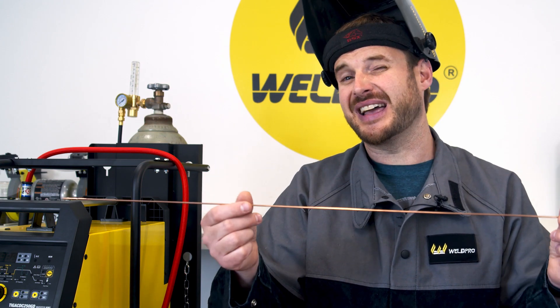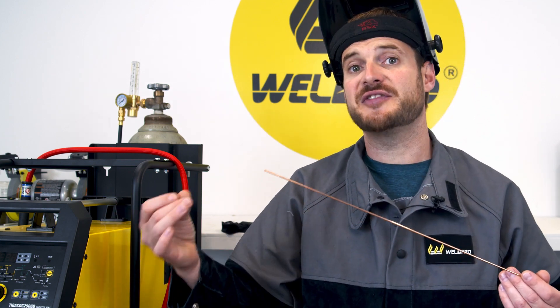On the other side of the spectrum, if you're going to be welding some thicker material a 1/16th filler rod might not be enough. You would spend all day dabbing 1/16th filler material into the puddle just to get your groove filled. For something that requires a higher filler deposition you might use something like an eighth inch or at least a 3/32nd size filler.